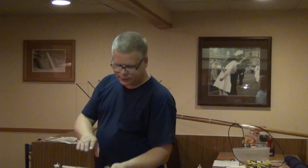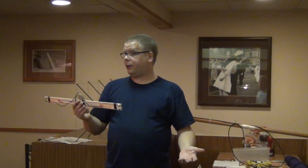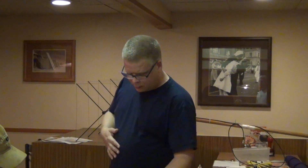One more important point about TDOA: it is not at all affected by signal strength. With other direction-finding methods, as you get closer your signal gets stronger and the S-meter is full-scale everywhere you turn. With this, even right next to a 50-watt transmitter, you'll still get that phase adjustment — the tone going present or away — regardless of power. So if you have a signal too powerful for your S-meter, you can switch to this. It's essentially a simplified, dumbed-down version of a Doppler direction finder.